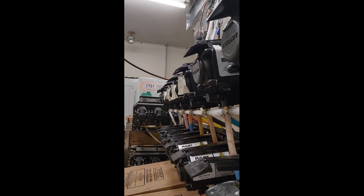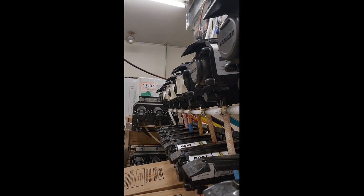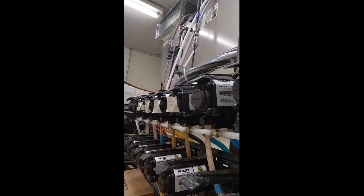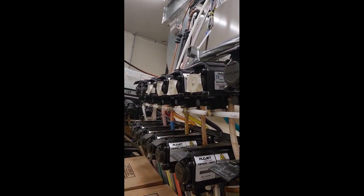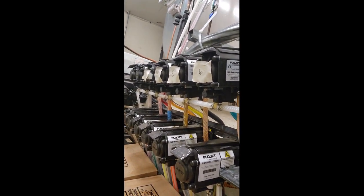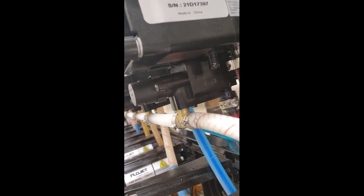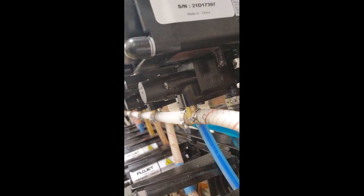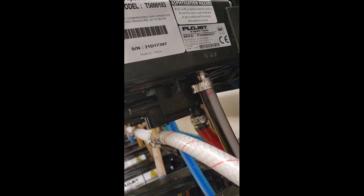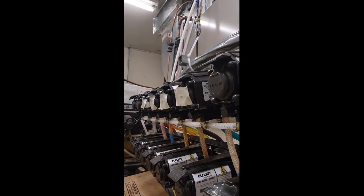And that's about all I have on this one, everyone. Again, this was an issue with the soda machine and Slurpee units not having enough CO2, not having proper dispense levels. And it ended up being that the auto shutoff valves were the wrong type. They were for high altitude and not for this particular location.